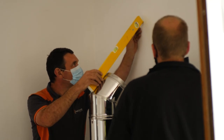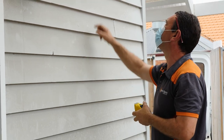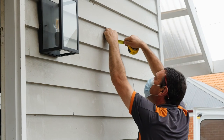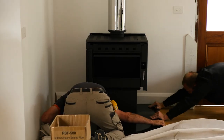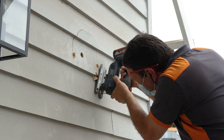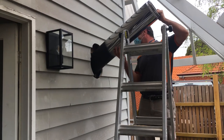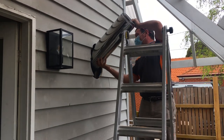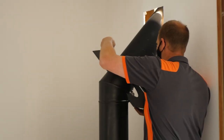Now this house, she's turn of the century — she's got a wee bit of age. We worked out there's quite a bit of lead paint on the wall. And in these original walls, the studs were a lot closer together. Being a smaller diameter flue, how would you have gone with the old-style air-cooled flue kits? We wouldn't have been able to get the heater in the centre of the wall where the customer wanted it and where it looks best. With the narrow diameter outer casing, we could get within 25mm of the stud with this kit.